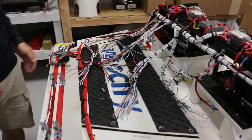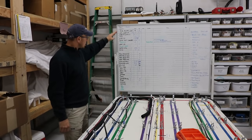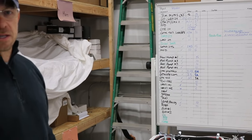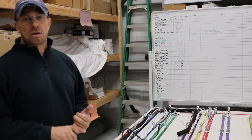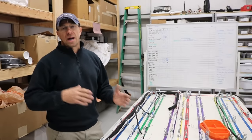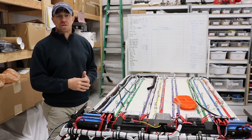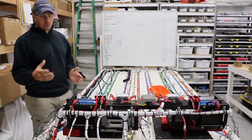One of the first things we do is we figure out exactly all of the circuits that are to be included in the aircraft itself. I really prefer the Vertical Power as a solid state circuit breaker package. The Vertical Power Pro is what we use for my essential bus setup. I do have a secondary blade fuse box for all non-essential functions. Most Velocities end up with somewhere between 30 to 40 total circuits.